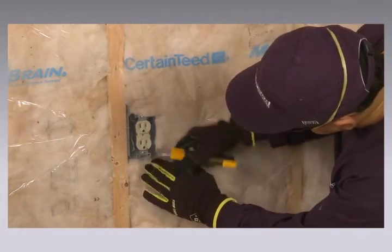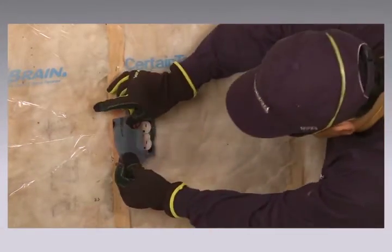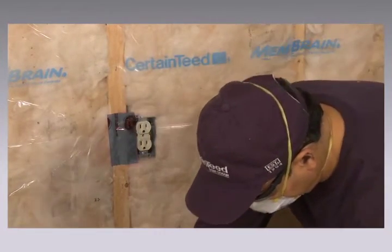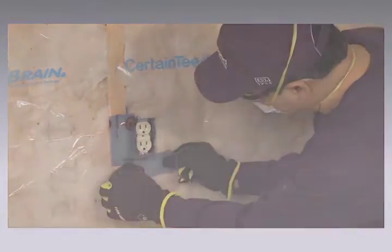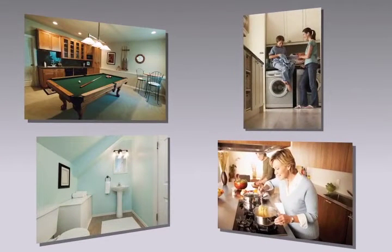Push the film into the obstruction so the film maintains its air-tightness. To repair any gaps or tears around the obstructions and seal the entire wall system along its edge, use an approved sheathing tape. Use membrane in moisture-prone areas like crawl spaces, basements, bathrooms, laundry rooms, and kitchens, and exterior walls to help prevent mold and rot.